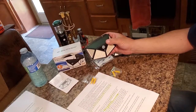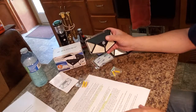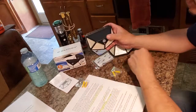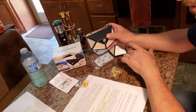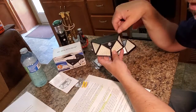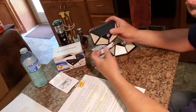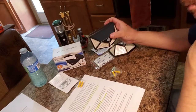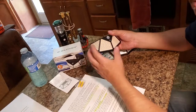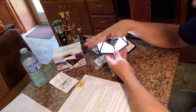For mounting on a travel trailer, utility trailer, shed, or house — if you mount them a couple of feet from the eave, they'll get plenty of light and charge fine. Mode one sets the light to bright motion-only: high output for 15 seconds on motion, then off, staying off until motion is detected again. Mode two blinks twice, setting it to garden low mode — at night it glows at low output, then when motion is detected it goes to high mode for 15 seconds, then returns to low. It'll run about six to eight hours on low before shutting off.